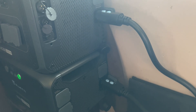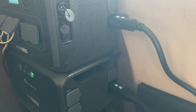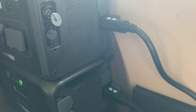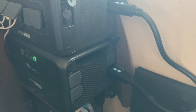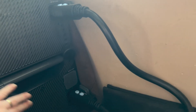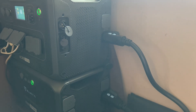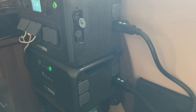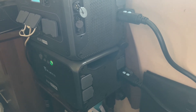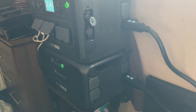To connect your battery — and additional batteries if you wish to extend — this system can take up to four B300s, giving you a maximum of 12,288 watt-hours of battery. They're connected in banks: you connect two batteries together and link them into one port, and the other two into the second port, giving you 12,288 watt-hours total. I consider myself a heavy user, generally sitting between 9 and 11.5 kilowatt-hours per day, and a system like that is more than enough to power your whole house.